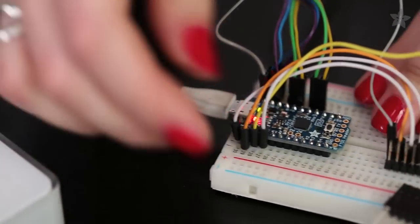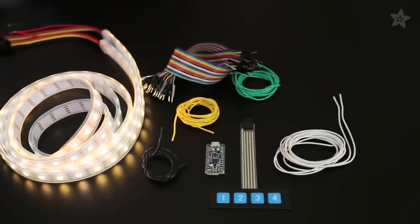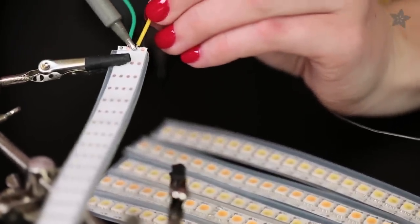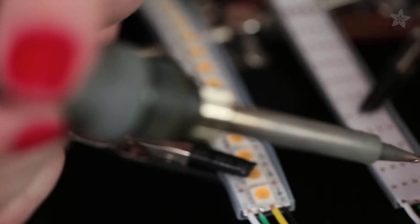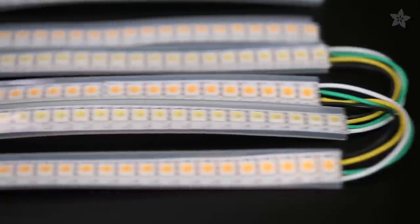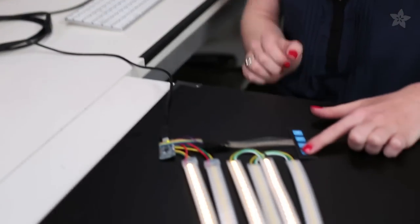It's a good idea to prototype your circuit with a solderless breadboard before affixing everything permanently, and if you can, have a second set of parts on hand to build your circuit using the prototype as reference. Start by laying out your LED strips and attaching silicone-coated wire in between them. Here's a pro tip for soldering to these tiny pads: solder every other wire on alternating sides of the flexible circuit board to help avoid short circuits. After attaching the LEDs to your Pro Trinket and the keypad as well, load up the sample program using the Arduino IDE and test that everything works as expected.